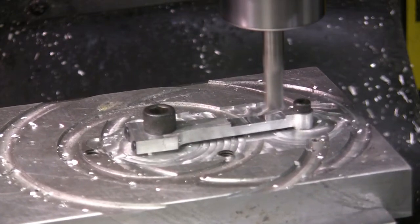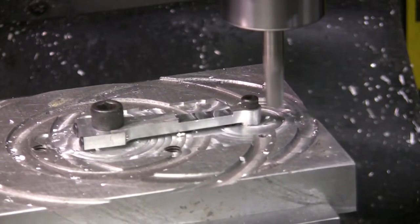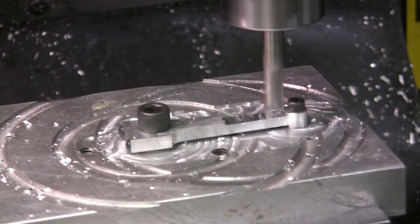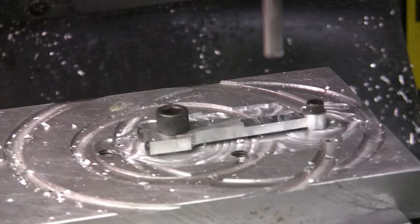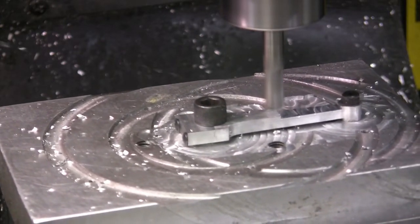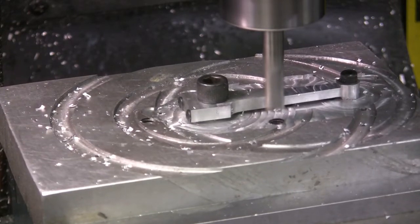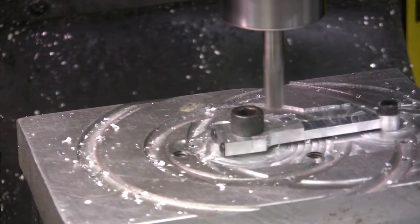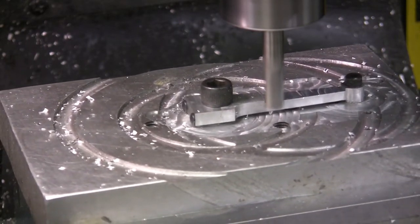After I get these done, I think I'm going to turn up the pistons next, and then after that will be the rings. I have some cast iron for the rings. The cast iron that I use is called nodular cast iron - the granules in the nodular are round. The other cast irons they're flaked. Nodular holds up better, it doesn't break. It has more yield strength, I believe.